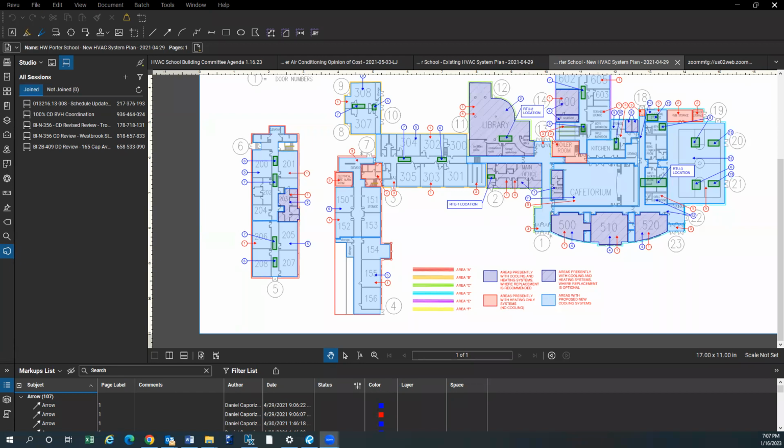Okay. That's actually something I kind of looked at to a degree. I don't know about the capacity in the switch gear, but one of the things I thought about was the actual wiring, so therefore the conduit, the trenching, the repaving, all of that. The wiring was in place for higher amperage. So could we go back to 1600, maybe not up to 2000 or 2400, but could we go back to 1600 without actually retrenching, putting new conduit and running new wire from 87 to the school? I haven't gotten an answer from any electrician yet on that.